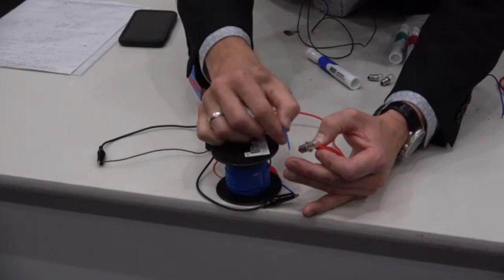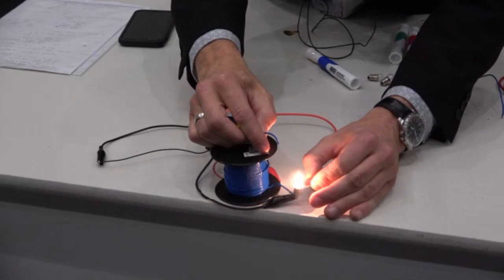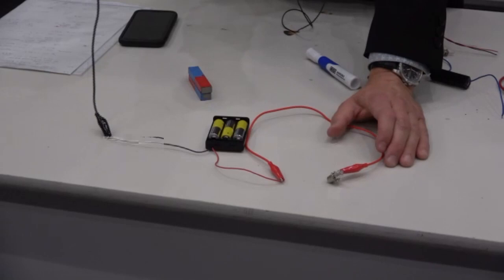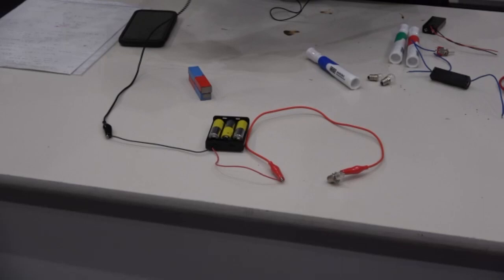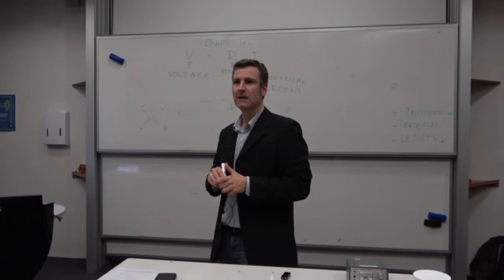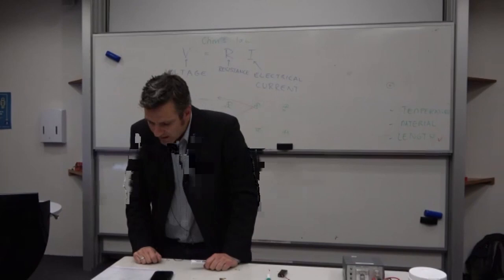It's still there, but can you see the difference now? Okay, again. Before, this is very bright. And this is a little less bright. You see it? Believe me? Okay, thank you. You see, although we have 25 meters, it's still not a super large effect. You probably need 100 meters next time, I promise. And then it would probably get really dark. So you see, length, excellent. Material, the same thing. It works in principle, but we have to work harder because the bulb itself has larger resistance.